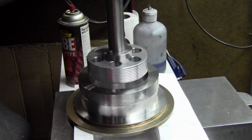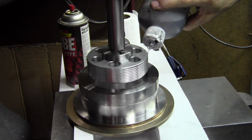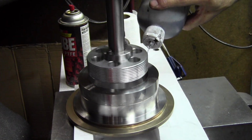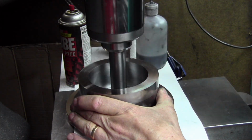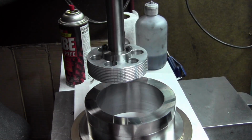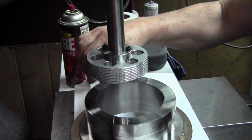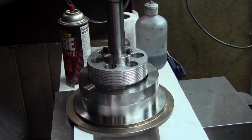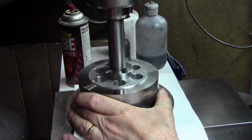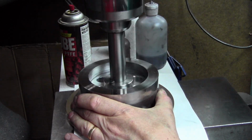Now we're getting ready to charge the brand new lap, shaking the slurry. Slurry keeps settling constantly, so you're always shaking it to keep the diamond in suspension. This is 15 micron diamond that I'm using on here, and I didn't have enough torque on there yet. If you don't have enough expansion, you'll just have tumbling action going on, which is good for rounding the lap up, but it's no good for actually removing material.